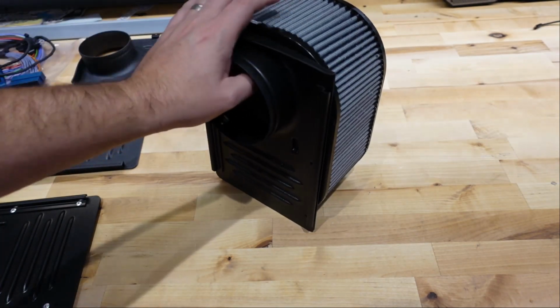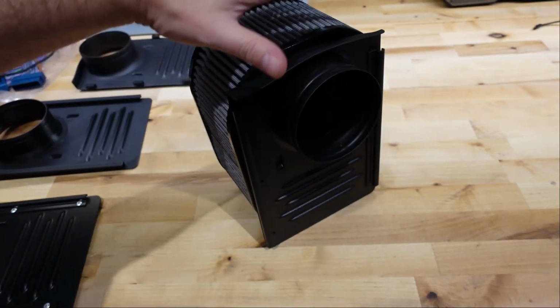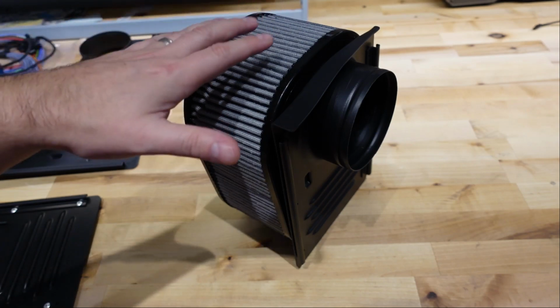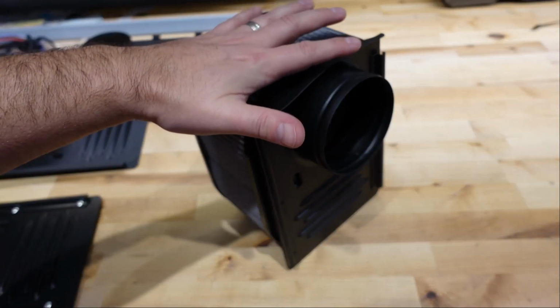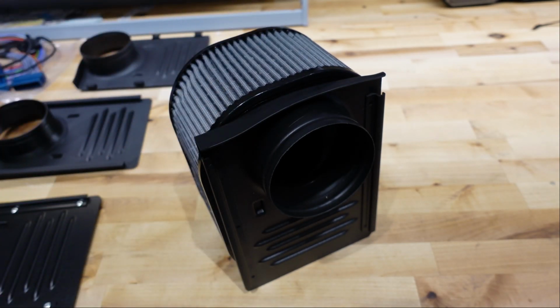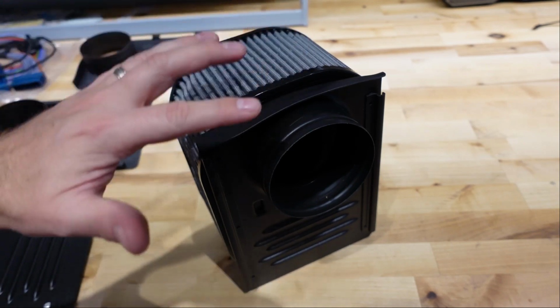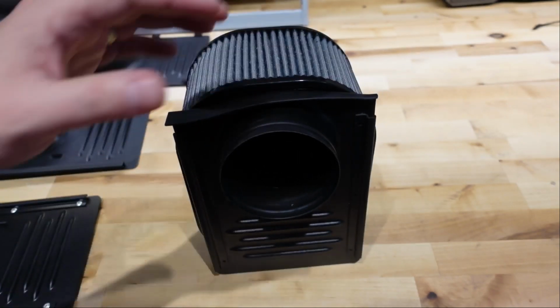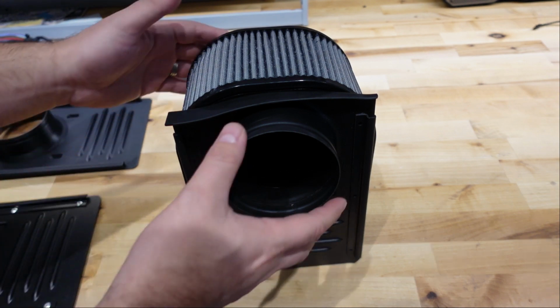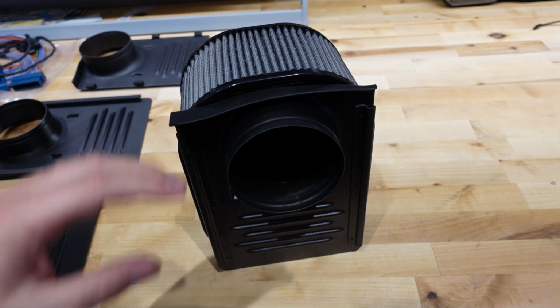So the next step of the phase is gonna be validating this, and then the actual top that right now we use a carbon fiber duct for, we will be modeling that in plastic as well. And we're looking at basically the same strategy. Do we 3D print that part out of a plastic? There's some carbon fiber, nylon materials, some composite materials that might be interesting for that purpose as well, that we might be able to 3D print. Or will we go again with a plastic injection molded part? I don't know yet. And that's kind of the part of the process of designing, developing, and testing a product. So that's where we're at with the program.